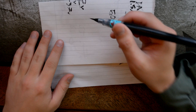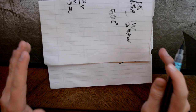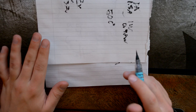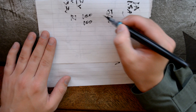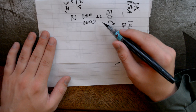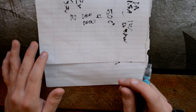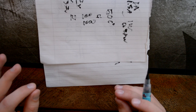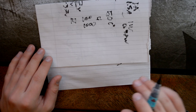Anyways, while this equation is fun and all, there is also a web page that I can link in the description, which can also calculate this for you, because if you want a certain output voltage, then you need to calculate the ratio. And do remember that R1 does need to be a value between 100 and 1000 ohms. So, keep that in mind. In any case, doing some different calculations, and also adapting my calculations to what was available to purchase, of course, I can't purchase any value of resistor, and I don't want to collect a lot of them in series to get the exact value. It doesn't have to be super exact, but it's nice if it's decently exact.